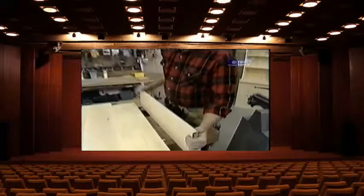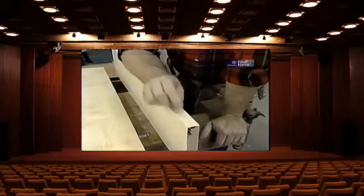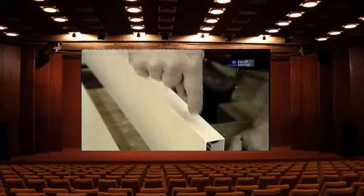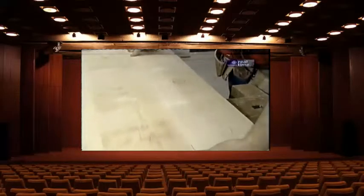But you know, maple is a real hard wood, and it doesn't absorb glue into its pores like a softwood does. So to strengthen the joints, traditionally, dowels were used. You would drill a hole in each piece, slip in a dowel, and join the boards together. But today, the technology has changed, and now we use a different system called biscuit joining.